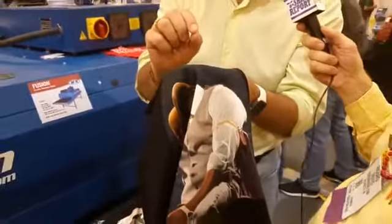Now, what's this final color? There's a black texture. Yeah, this is Cube. This is Cube product. It is a high density ink, water base. And as you can see, it's possible to have high density respecting also the fine line. This is due to the possibility to use very fine mesh, high density emulsion. But first of all, the ink must not be too sticky. Otherwise, it's very difficult to transfer over the mesh and requires much more pressure and you destroy the design, or it requires using coarse mesh. That is not the case.